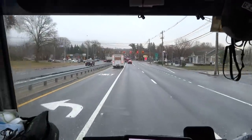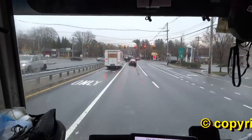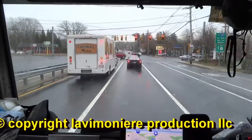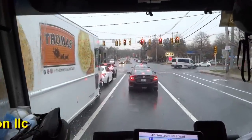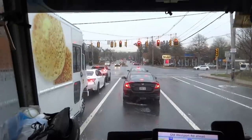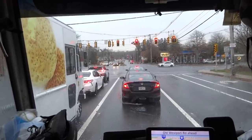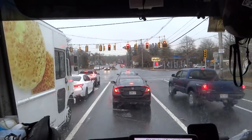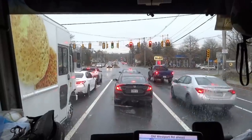Guys, December 6, 2021. This one here, I gotta go change a power vented water heater. Direct vented outside the house, a 50 gallon. I was over there Saturday afternoon and couldn't get the gas valve to fire up the unit. Tried a couple of different things, cleaned the flame sensor, and I guess the unit's probably 12 years old or something. It's not worth getting another gas valve for it, so I'm gonna rip and tear it.